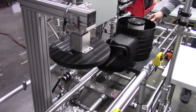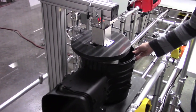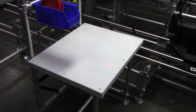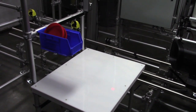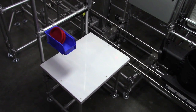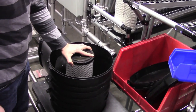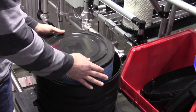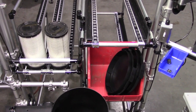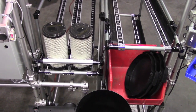Having the product on a fixture and cart provided effortless flow through production. A small freestanding workstation provided a space to perform offline work, and its second function was to provide a safety barrier around a downstream pressing operation. The bulk of the second position's content involved pressing in two different large components. Custom flow racks provided point-of-use parts presentation, reducing wasteful handling by the operator.